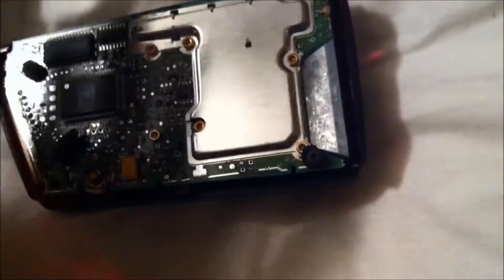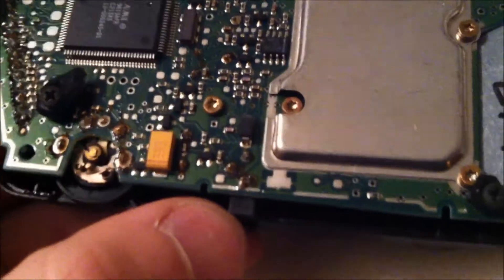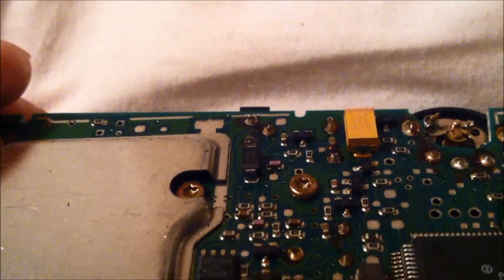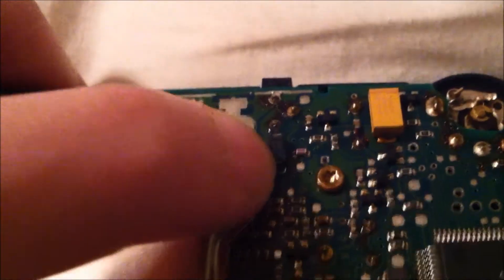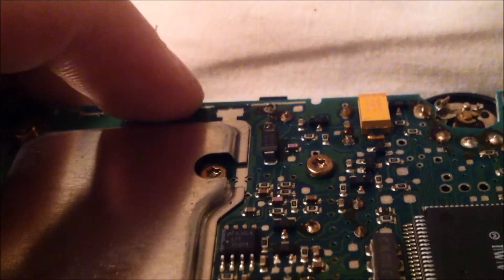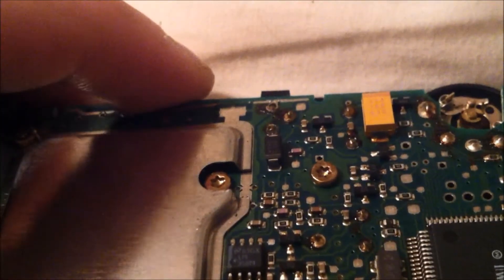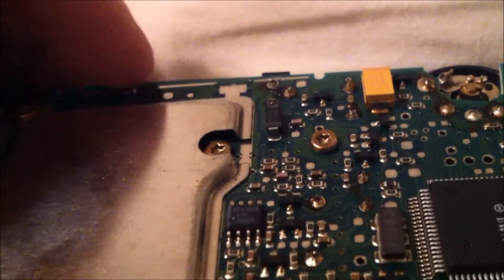Take your four screws out, that pops off and you'll notice right here — we'll see if the camera will focus — okay this side you can see the leg by this diode. See that little crack? And this over here looks kind of tarnished. That's actually called a cold solder joint for this pin right here.